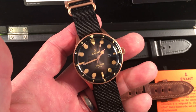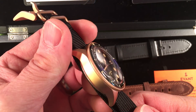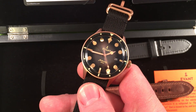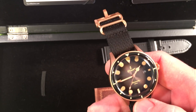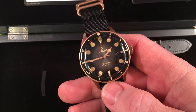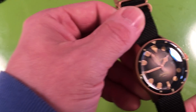I'd wanted for the past year a watch with an ETA 2824-2 movement, but I didn't want to get something like a Steinhart. I wanted something unique, not just an homage to something else — something that stood on its own two feet. There are four grades of the 2824; this one is the 'Elaboré,' which is the second from the bottom. It's been adjusted in three positions to about 10 seconds a day. The top grade is Chronometer, then Top, then Elaboré — so it's the next one up from the base movement.